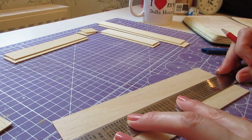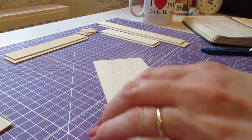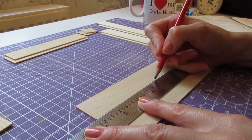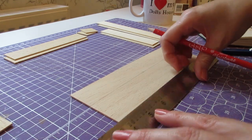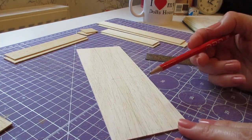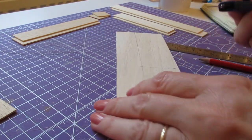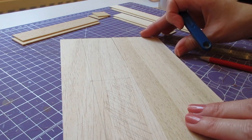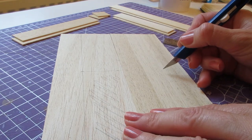Place the ruler just below the pencil marks to allow for the thickness of the pencil nib. This will be the inside or centre of the piece, so I want to come up by 100mm. These measurements you can decide yourself — you might not want such a large opening — but this is uniform with what I've already got in the dolls house. Join that up, and then I mark the area to be cut away with a little squiggle so I remove the right piece. Start by making a small cut-out at each corner of the section being removed.